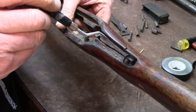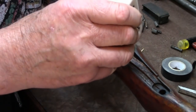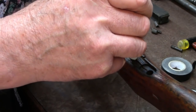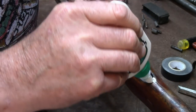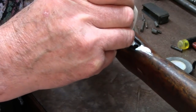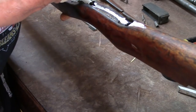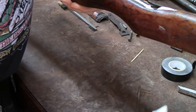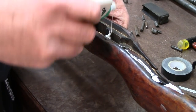I want to make sure I get glue as far down as I possibly can. Where I can't get it, I can use compressed air and gently ease it in. I'm not going to be shy about how much glue I use — I want to really get it in there. Another simple thing you can do is open and close that joint a little bit; that will suck that glue right down in there. If it runs out the other side, all the better. I want that glue joint well saturated.